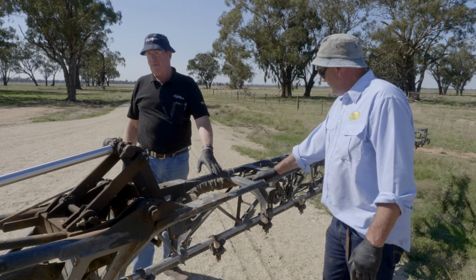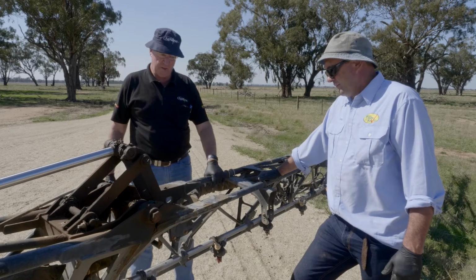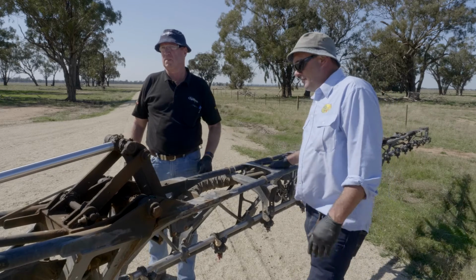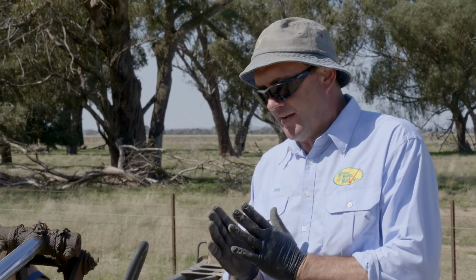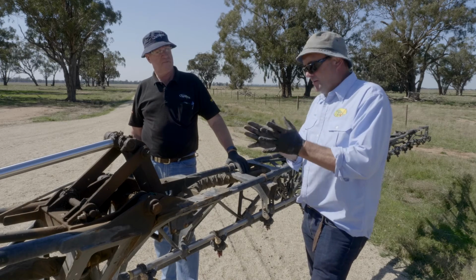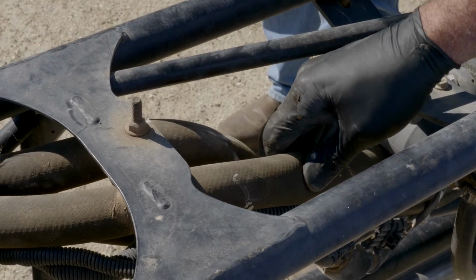So Craig, we're here at the pivot point in the boom, and I've seen some situations where this has been a damaging point for hoses. Do you want to run through this one with us? Yeah, well look, hoses don't last forever, so if they lose their integrity, they can actually delaminate, and you can get chemistry getting stuck between the inner layer and the outer sheaths. And if that's been acted, it'll crack, and then that material can just migrate around. I've seen hoses blister, all sorts of things happen with hosing.